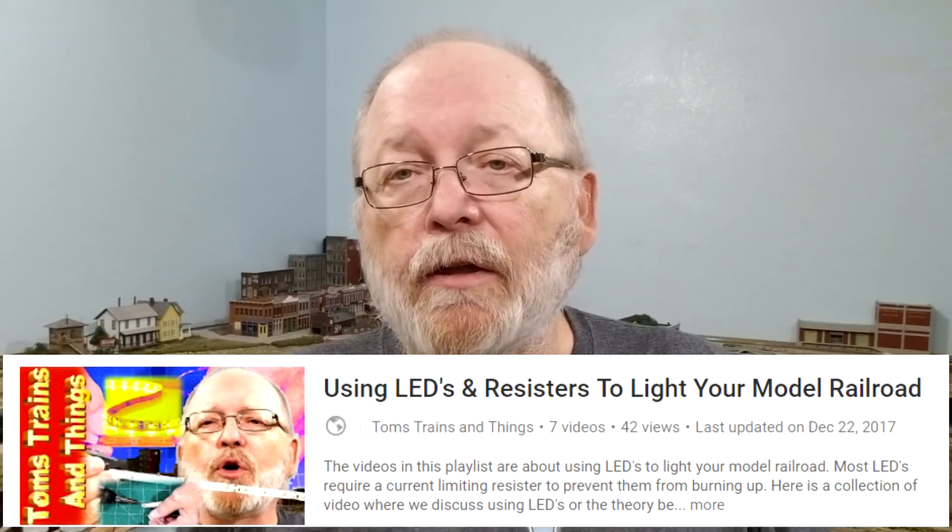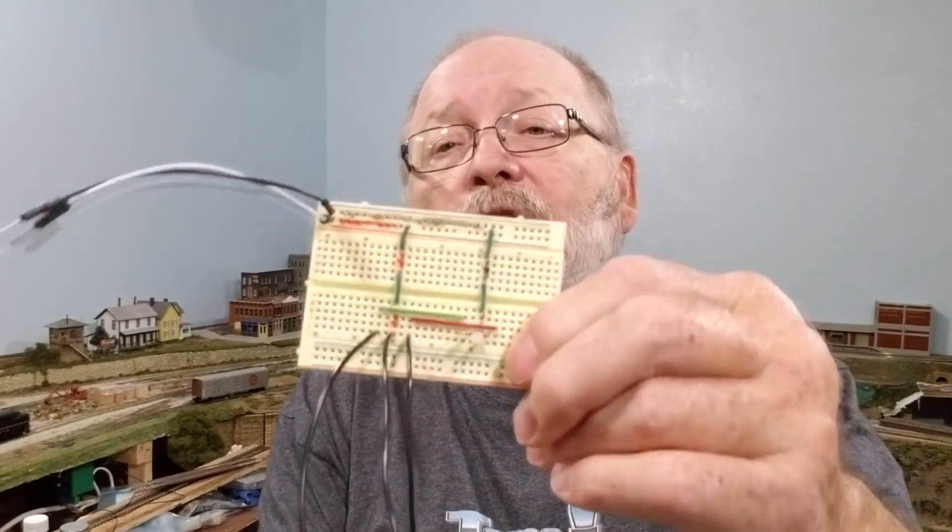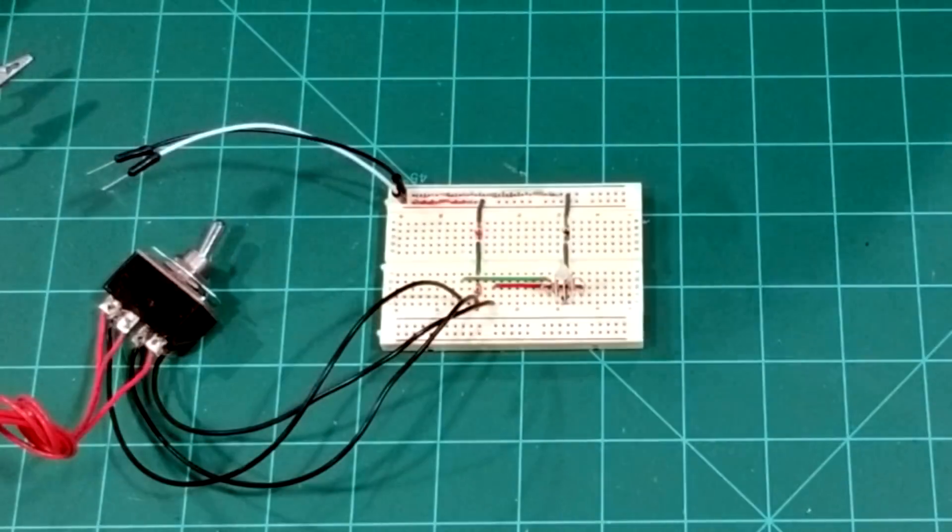If you take a look at some of my other videos on LEDs, you'll be able to see how I test what resistors to use with particular LEDs. Not all LEDs are the same, and not all resistors are going to be the same. A lot of people tell you to use a 1K ohm resistor, and that's good for some LEDs but not all. Check out my playlist for LEDs — I'll show you how to test them. On this one here, I started out with 1K, which made them too dim, so I worked my way down to 470 and a 220 ohm resistor.